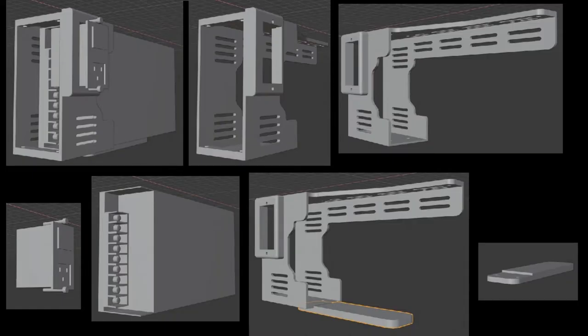After that we have the power supply support. I did change this at the last minute — initially I designed everything to be mounted on the left side of the unit, but I decided to put it on the right side. Instead of redesigning it, I just flipped it 180 degrees. When I did that I had to make a small support board to fit underneath the power supply mount to keep it from sagging. The whole mount connects to the side of the main board box with four M3 screws and nuts.